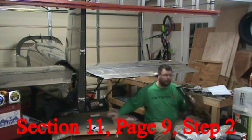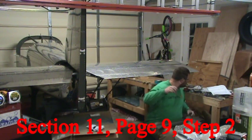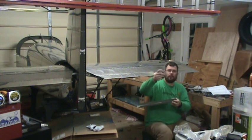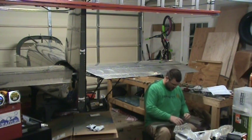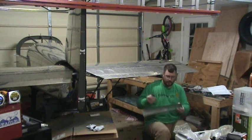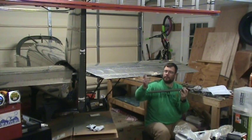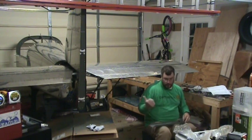Okay, now that that repair is complete, we can continue back to step two, installing this. Basically you want this upside down, to go in with the little hole and the big hole towards the bottom and the back for your left side. Basically, the side with three holes on it faces to the small end of this bracket, and the corner with the one hole out here by itself faces to the open big end.